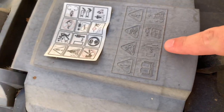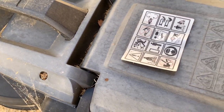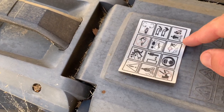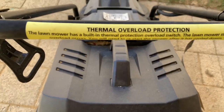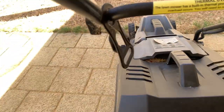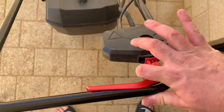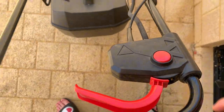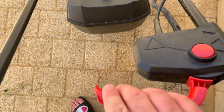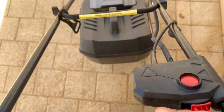We'll just go through the warning labels here. Obviously don't push it uphill, don't put your hand in the blades when it's running, obviously wear ear protection, don't have people standing next to you while you're lawn mowing. We've got this thermal overload protection here - if you guys want to pause and read it I'll try to get it to focus. To operate this machine you'd obviously have it plugged into a powerpoint with an extension lead. You've got to press that down and pull that back - see how the button's down. Once you let go the button will pop up, and that's like the kill switch to stop it. If you press the lever the button doesn't go down, so you won't be able to operate it. Once you click it down and hold at the same time, you'll be able to use it.